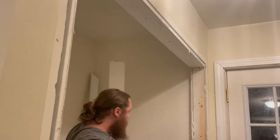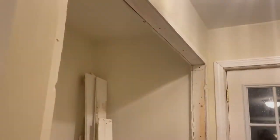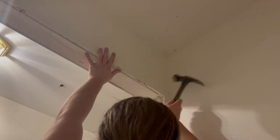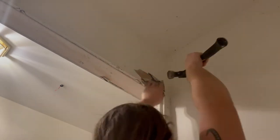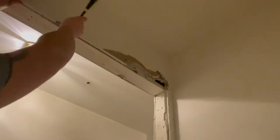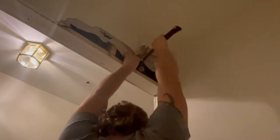Removing the trim felt so good that we decided to take the demo one step further and remove the wall that framed in this closet door. The wall was framed for a five-foot bifold door, which means we have a few inches on either side of wall that we don't need anymore. Also, the top is six foot eight inches high instead of eight feet like the rest of the ceiling. So by removing this wall we're not actually gaining any more square footage, but it does make the space feel more continuous with the rest of the house and it's going to allow a lot more light into the space.